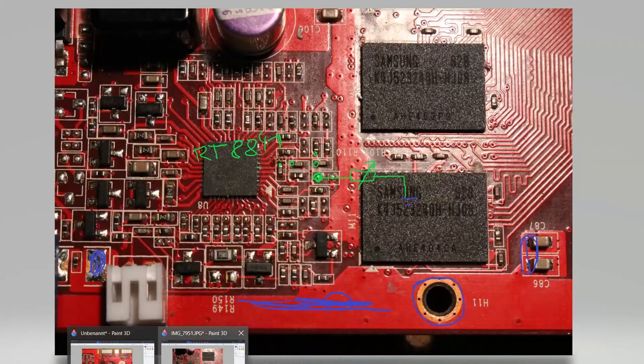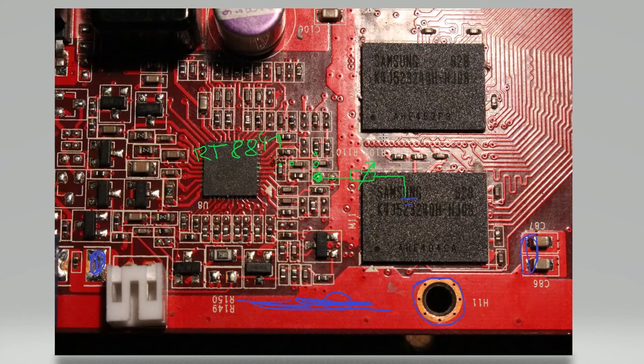Let's go back to V-core because I forgot to tell you the resistance values. This is one of those very common cases where 20 kilo ohms is good for everything. I would suggest 20 to 50 kilo ohms on the high end on this one. 20 would be more fine-tunable, and 50 also works but just not as fine. Bigger resistance is always possible with these basic feedback mods because the only thing you're losing is sensitivity. There is no risk of over-volting or killing any hardware with too much resistance — only too little would hurt, because it's basically the inverse of the resistance that determines your V-core.